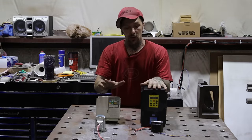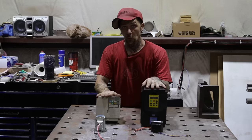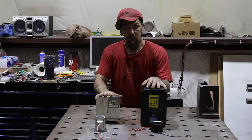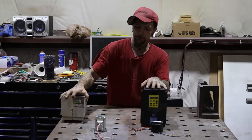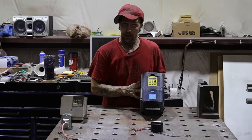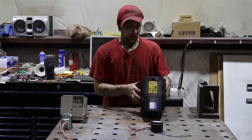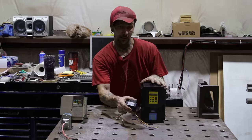When I got the saw, it was supposed to be 460 or 220 volt. I don't have 460 in my shop, so I figured I would just convert it to 220. I did as much research as I could and I ended up getting a 220 to 220 VFD and a transformer to replace the one that's in there.